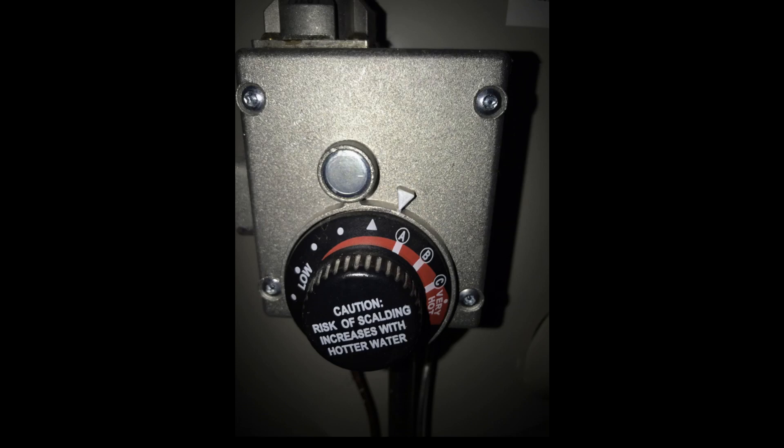Here are some tips. The temperature of the element in your hot water cylinder should be 60 degrees Celsius, or 140 degrees Fahrenheit if you live in the United States. Don't make the temperature higher than this because it will just keep heating up your hot water, waste power, and doesn't give you much benefit. One other thing you'll notice is that because you're using a lot more hot water you will use a lot more power. My hot water cylinder is heated by solar power — before the pressure valve it would take about two kilowatts to reheat after a shower and dishes, but after increasing the pressure it was using four to five kilowatts.